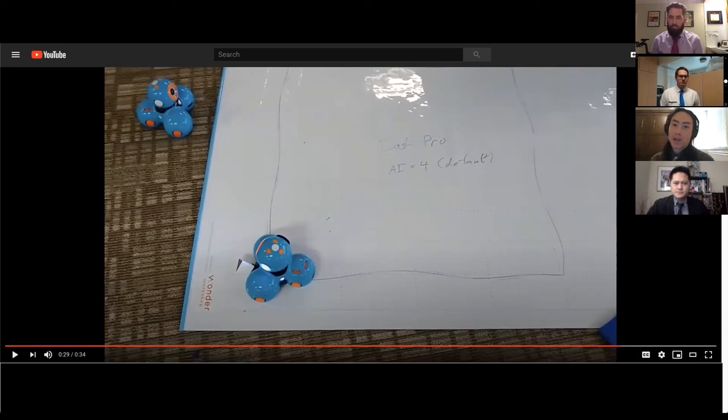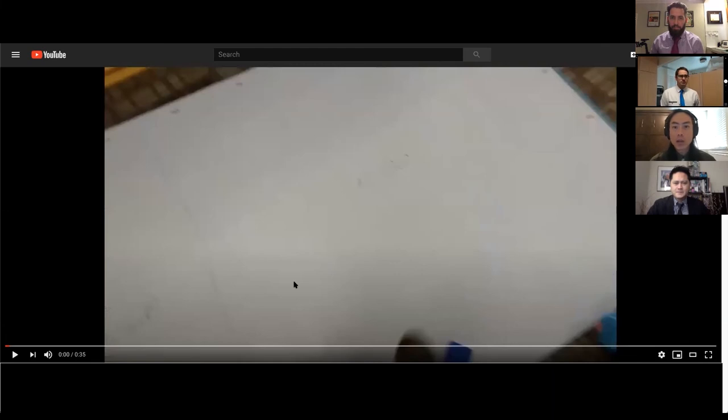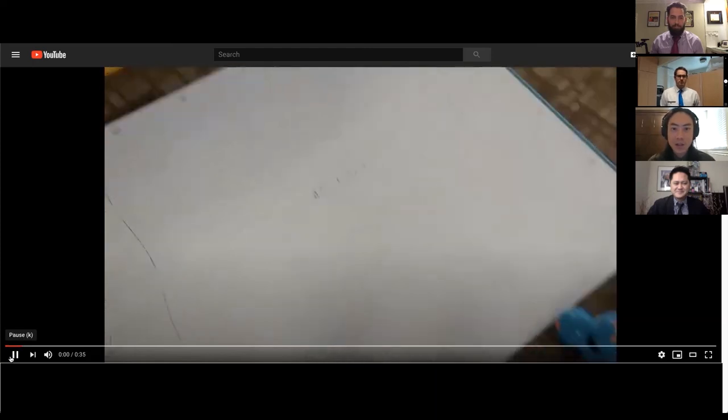So just for fun, we increased what is called the integrator gain, which is one of the gains of the control system, which was at 4, we increased it all the way to 120, which is multiple orders of magnitude. So let's see what happens when we do this. So check video number 5, please.